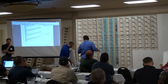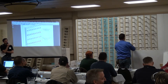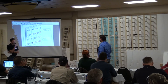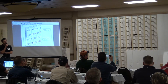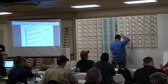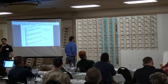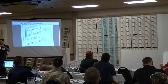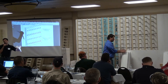When building our walls, you'll be sliding panels up all the time for access to the inside — mainly for rebar installation and tying. If you drop your tape measure inside the wall, you can slide up a panel and grab it. As we build, you put the C-channel on one side and leave it off the other side so you can always slide panels on that open side. That's one of the last things you do — once the wall is all braced and you're done with that section, you go ahead and put the other side C-channel on and screw it together.